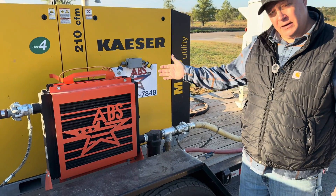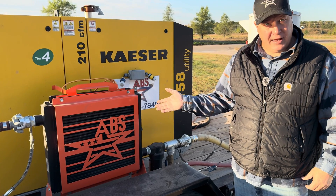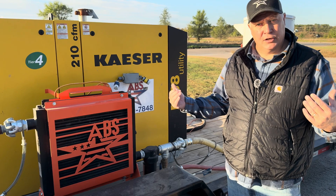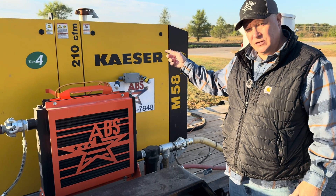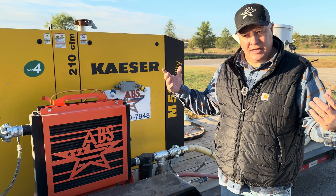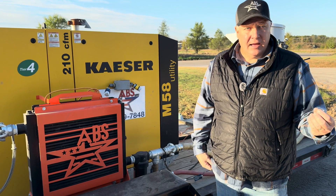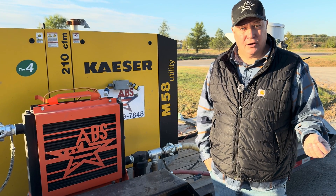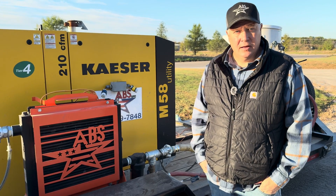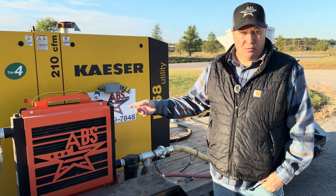Now that we've got the after cooler, I'm not going to plug this in right now because the fan makes a lot of noise — this way you can hear me better. But at the end before we start blasting we will hook this up and show you how it's stripping moisture out of the air. These air compressors are literally water pumps. What they do at our elevation here in Minnesota is they compress the air eight to one. So on a humid, muggy morning — when you walk through the grass and your shoes get wet — when we condense that eight to one, we are actually pumping water into the pot if we do not have something to remove it.